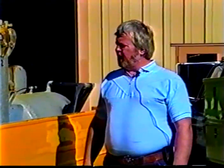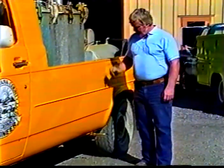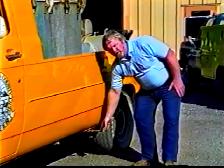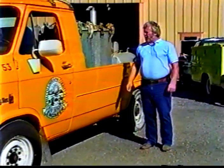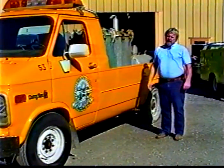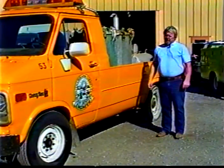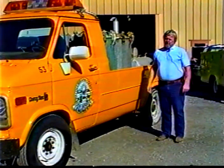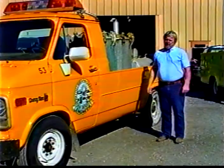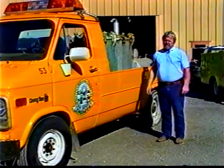At the end of each day, we add 2 to 3 gallons of solvent in each of the tanks that we use for the day, and then we flush the system, and these are our drains, our cleanouts to get the solvent out. Other than that, that's about all the work that we do on a daily basis as far as preparing the machine for the next day or for storage. Annually, we do clean the insides of the tank. Most of the time in the spring, the paint is set up better and is easier to remove the residue and stuff that's inside the tanks.